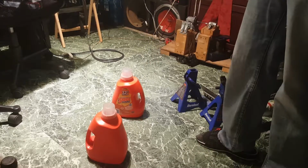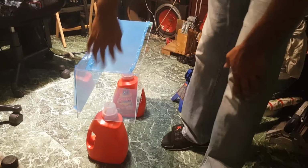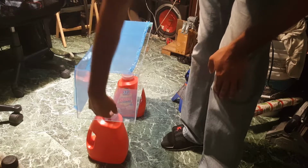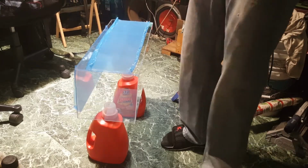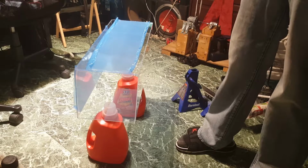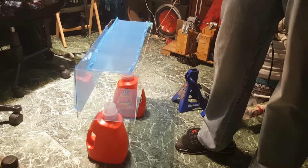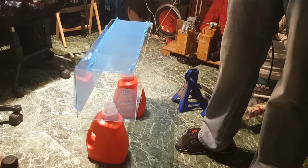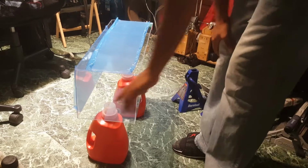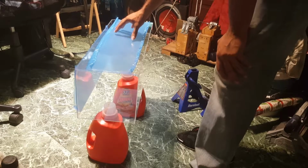So basically what I'm going to do is just like any other trap, this will have a door in here that's like all the way in here, and that could lift up and close down. And I already got my code written up for my Arduino and my ping sensor, so you guys seen that. And I may adjust the code a little bit here and there once I get everything working, so I just need to adjust the distance, because I want to make sure that if anything ran in here, the ping sensor will definitely pick up on it from whatever distance it is.